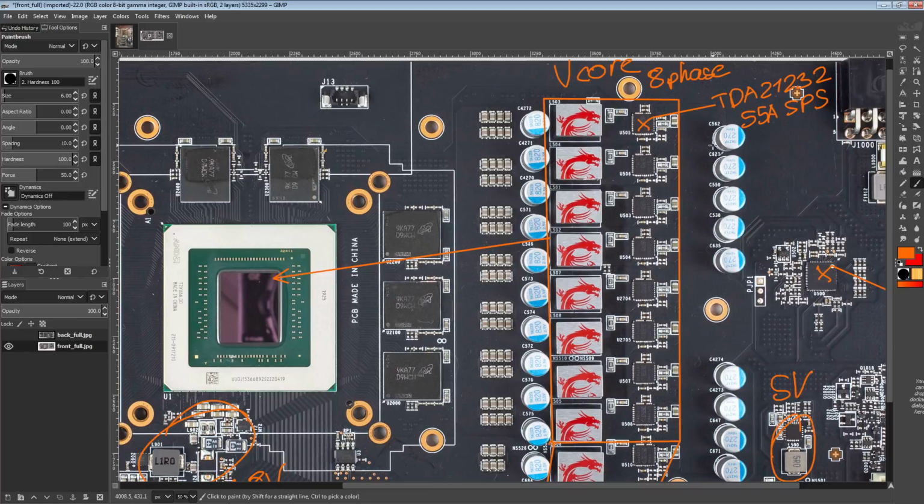Because that uses the full size 60 amp 5x6mm power stages instead of these ones. These are all server grade parts, but these are the more compact variant meant for high density applications. So these can't handle the really high current outputs quite as well.